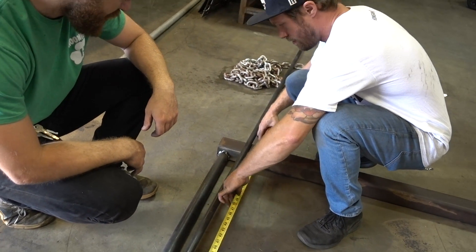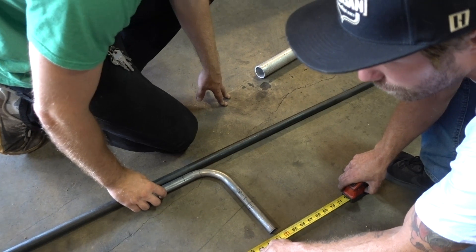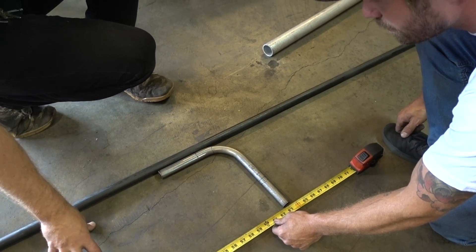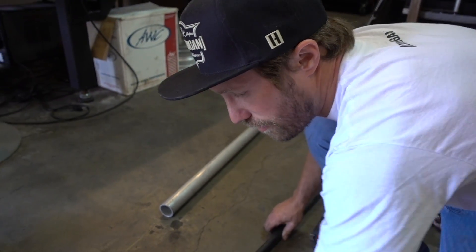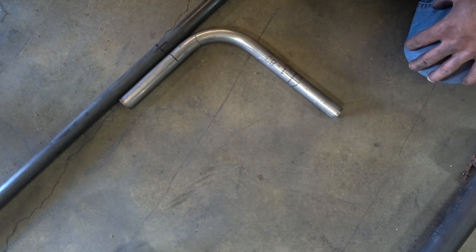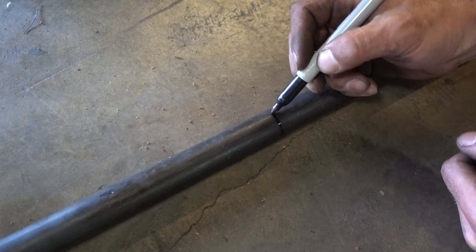So you have a visual reference of where you want to be. You put the middle of this one at 63. It's going to be a little bit more difficult to judge because that's going to go out about an inch. Let's just push it back just a little and then we can mark here at the beginning of our bend. What I also do is take that marker and try to mark the very top of it just so you know when you're bending that it's straight up and down — you want to keep that in line. However, we're going to bend this the opposite direction so we need to flip it over and do the same thing, because if we bend it from here it's going to go the opposite direction. So we have to do it upside down.